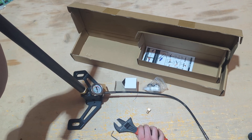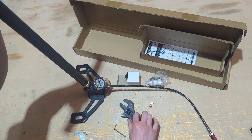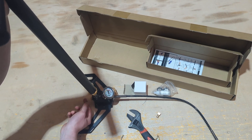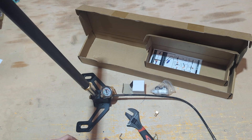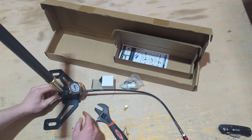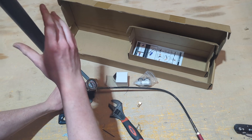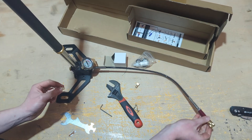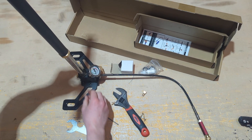If it does leak from anywhere, tighten up those key areas we spoke about. If it's leaking out the back, your bleed valve isn't closed. Don't just eject the test plug, otherwise it becomes a projectile. You need to open the bleed valve on the back to release the pressure within the line, then you can remove it. And that's all sorted.